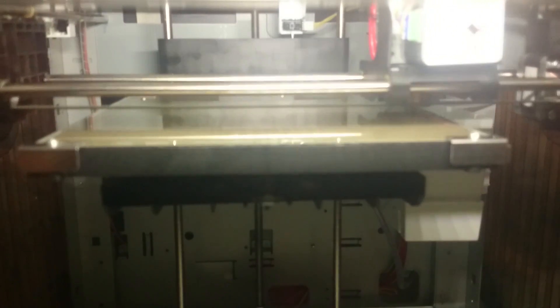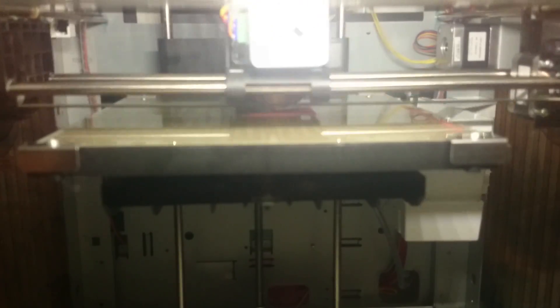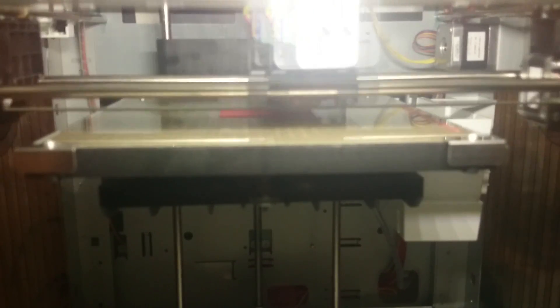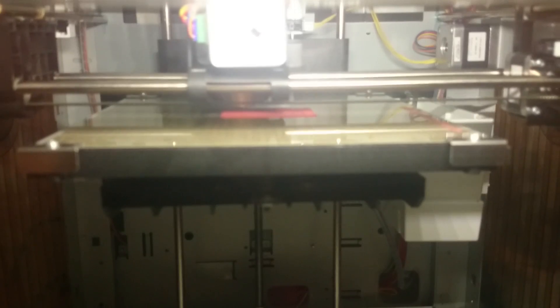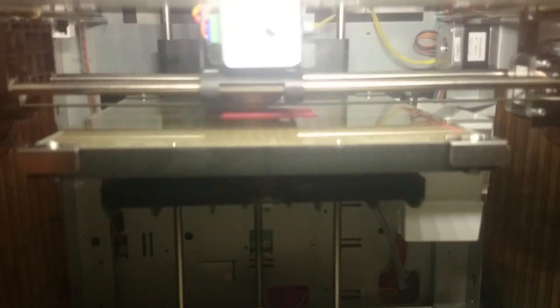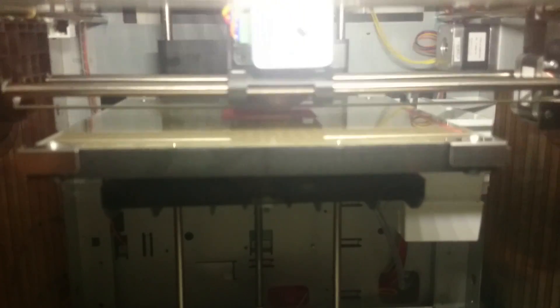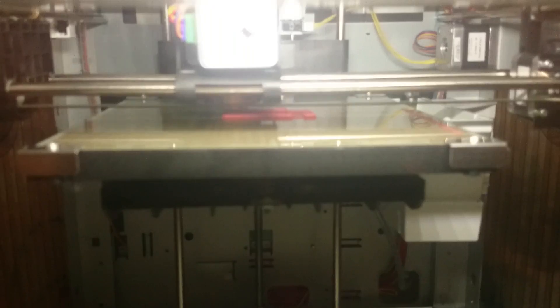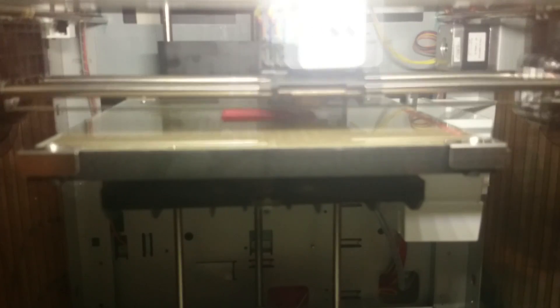So this is the time lapse video for the part I printed out earlier. I just wanted to put a few words to it to share what I've learned from this experience. Now that the printer's all packed up and put away, I can reflect on a first night's printing. As you can see, this part's printed out with a raft underneath it — that was an option I selected, and that wasn't a good idea. The raft becomes permanent to the parts; it's not like support material you can just pull off. It's permanent. So I'll have to print this part again.